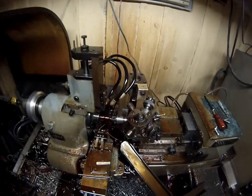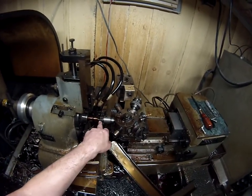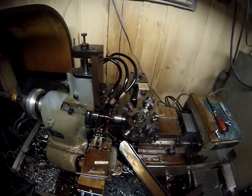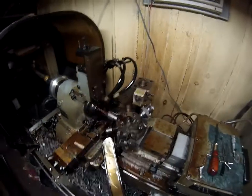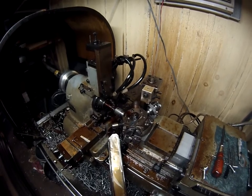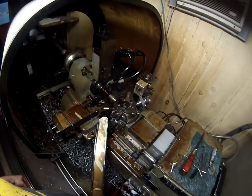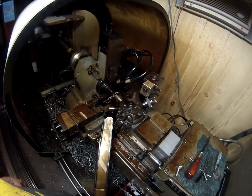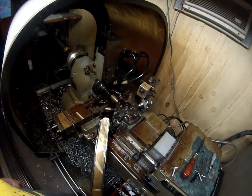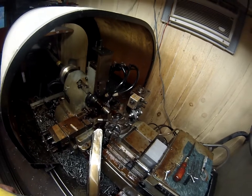So that was the first step — the stock stop — and now we're doing the rough hollow mill right there. It's got three cutting teeth. Low speed, low feed — that's what steel likes. And it's 1018, so you can see it's really hard to control the chips. Stringy chips — that's what makes this a babysitting job.